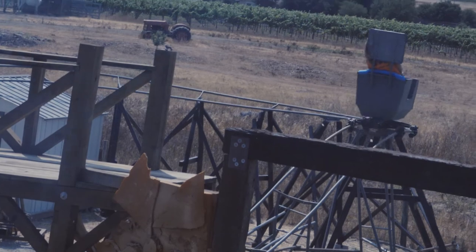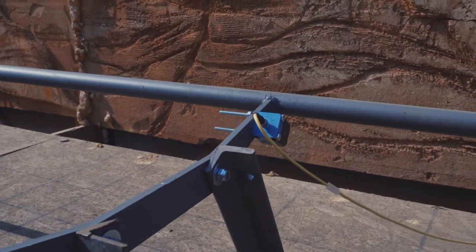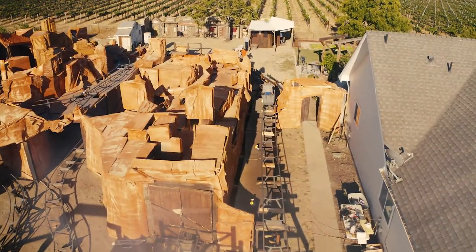All of that is attached to a large concrete block, so it basically just hits that block and stops. But the cart continues forward. Once the cart clears the hill and is making its way back to the station, it trips another sensor, which tells the PLC, hey, I've cleared the hill. It's okay to reset the system. At that point, the launch doors close, the emergency brake goes back up, and in a perfect world a vacuum pump turns on, which would pull back the rod.